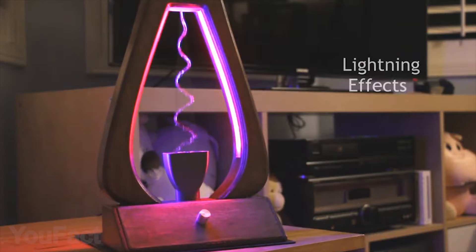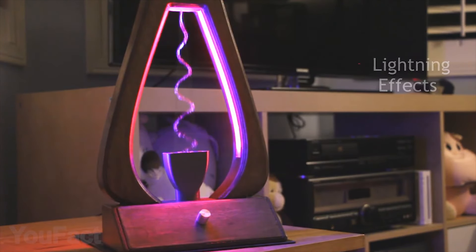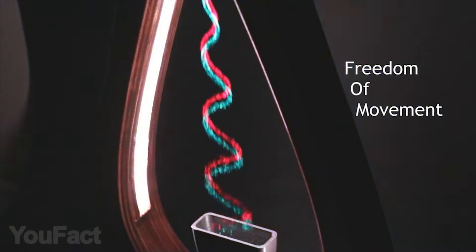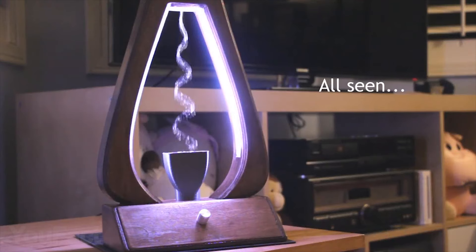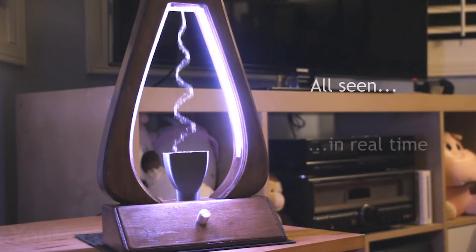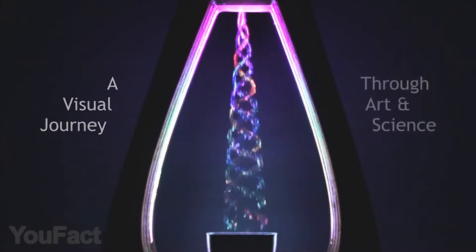This fountain lamp is built with 60 LED lights. By varying a portion of these LEDs at a frequency range of 75 to 100 hertz against a synchronized and vibrating stream of water, we can create snapshots or frames of the water at various places in time. A set of these frames can form an illusion of an animation.